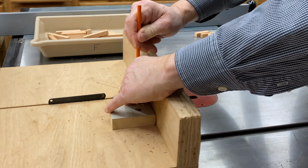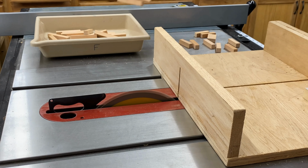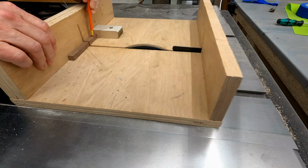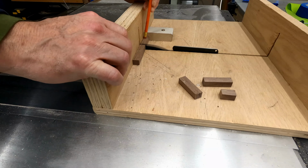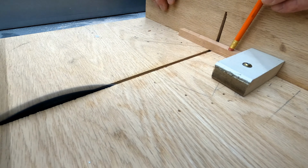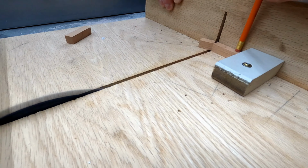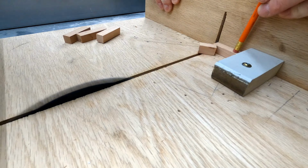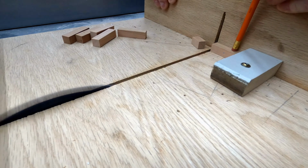My plan was to cut a bunch of different lengths so that I could arrange the blocks in a cascading waterfall pattern from one corner to the opposing corner. They ranged in lengths from 2 3/4 inches to a half-inch. The larger pieces would form the base and the smaller pieces would be used for the top of the piece. The gap in between the top and bottom would be filled with a new epoxy that I'm going to try. But I'm getting ahead of myself and the problems I encountered there. For now, let's just make some cuts and then get creative with the arrangement of the blocks.